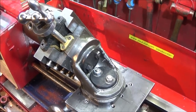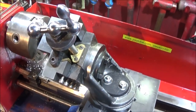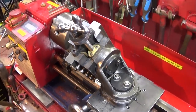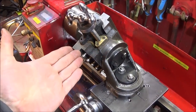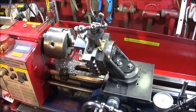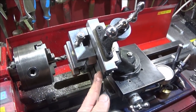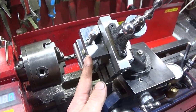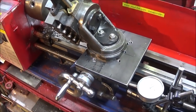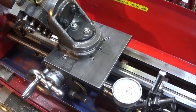With this setup I can make use of the milling slide's swivels and do various types of angle work. Having done this, I reckon this is actually the best milling slide you can get for this lathe. You can get the genuine Myford ones, but this is a copy and it's very good quality. I got this milling slide from Kronos, along with this milling vise and a piece of plate already cut to size — 10mm thick, bought on eBay.